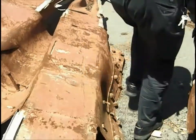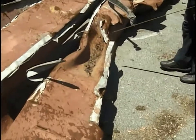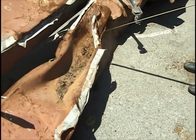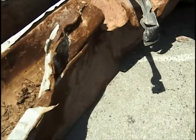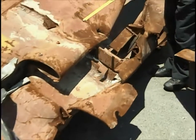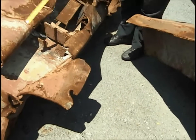Both the shelf and the damper are gone. We have collapse of the box in between the top and middle spandrels with weld breaks here. In the middle spandrel, we have failure — pull-through of the bolts, a little bit of tearing of the spandrel.